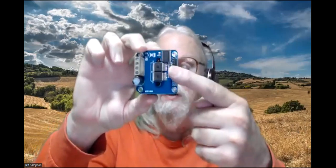So anyway, they start off with this diagram. They did not connect the VCC pin here on the H bridge, but it turns out since they put 5 volts on both of the enable pins, I think it's powering the board through the protection diodes of that. So it still works, but nobody seemed to be smart enough to realize that's not the way you should do it.